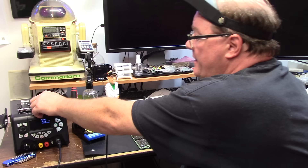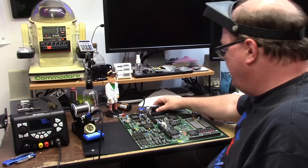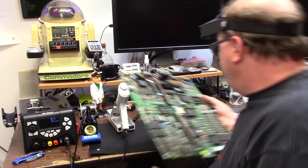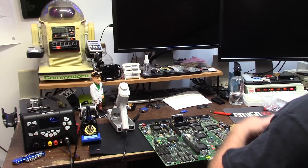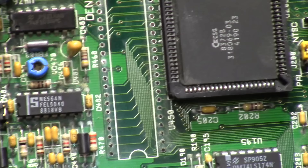So we're going to pop them out using my premier chip removal tool — Chubby Checker edition. Come on baby, let's do the twist. Plus, if I mess it up it wouldn't matter because I'm fixing it anyway, right? It's still ashen out even though I cleaned it. We're going to remove Denise and Paula and take a look underneath. Two sockets out — like normal, I cut them in half on the ribs on top and pull out a side at a time. I pulled out approximately this much lead — I could probably make some ammo. That's a lot of lead.